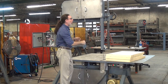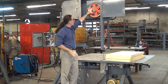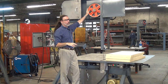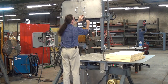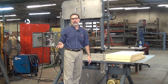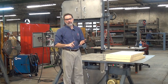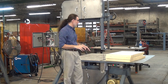The Model 236 is a tall machine, built with four 14-inch diameter wheels. This allows you to run a half-inch or three-quarter-inch blade — some one-inch blades work as well, though not particularly thick ones. These are high-speed machines: the blade runs at about 3,000 feet per minute. Contrast that with metal cutting, which might be 300 feet per minute or slower. At 3,000 feet per minute, it's suitable for cutting foam, plastic, wood, and all manner of materials — basically anything other than ferrous metals. You can sometimes cut aluminum with these machines.